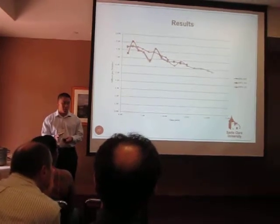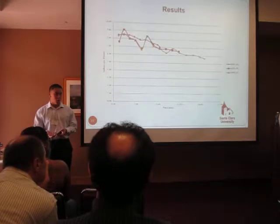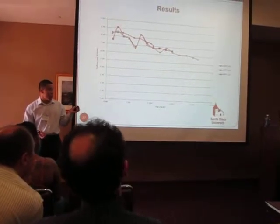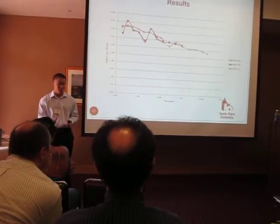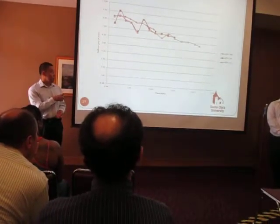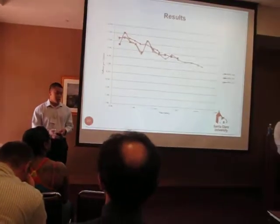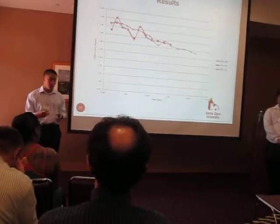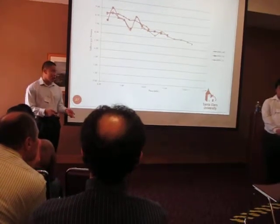Based on our results, we're able to measure that, as Ken mentioned earlier, there's initial baseline pressure stored inside the pressure tank, and it's set at 40 psi. And to get our maximum water storage in there, we lowered it to 25 psi. And as seen here, we're able to pump more water through the tanks as we lower the pressure inside the tank, because obviously the pump doesn't have to work as hard to pump against the high pressure stored inside. And our flow rates are right here, which are the average flow rates, which are still above 4 GPM, which is desirable because with our pressure regulator, we're able to slow it down to meet the 2 to 4 GPM required to irrigate the garden.